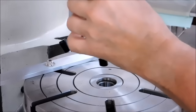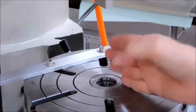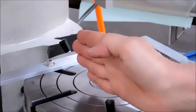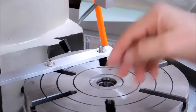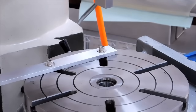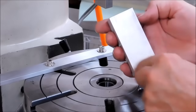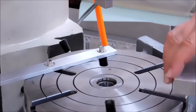My part is approximately an inch and a half thick, so I'm going to move this. I want the center of rotation three-quarters of an inch in from the part edge so I get a good clean edge on the part. I'm going to make a dog bone out of this piece, like a chain link. See how fast we can do it.